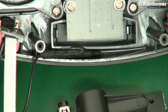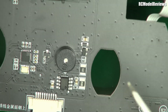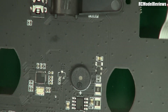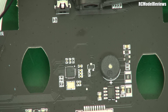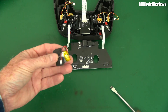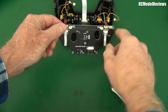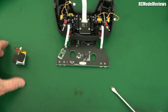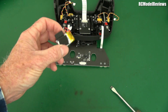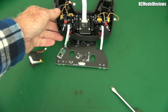That's really all you're getting for your money. Back by the microcontroller there's another chip — probably power management — and your buzzer, plus a few passives. What they're doing is using two of these single-cell lithium polymer batteries wired in parallel, giving you twice the capacity at the same voltage. All they then need to do is drop the 4.2 volts down to 3.3 volts with a simple linear regulator to power the components.